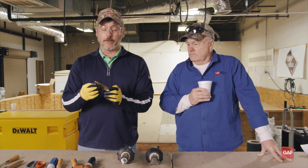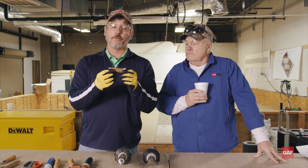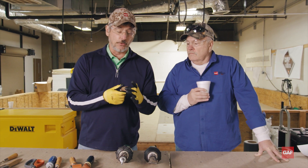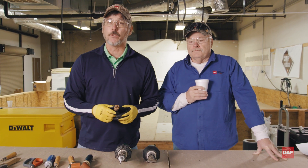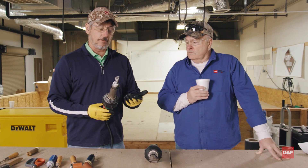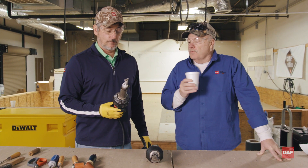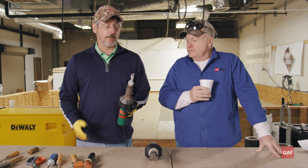The ceramic element looks something like this. As you can see, there's a big crack in this one — that could have been from shutting off too quickly or it just gave out. If you can, you should have a backup one of these in your work truck because they take some abuse, and when this element goes is when you're going to need it the most — rain's moving in, whatever the case may be. How often should you check these? I think at least daily, honestly. Minimum once a week or at least once a month. When you put them away, you should tear them down, blow compressed air through them, get all the dirt out, put it back together, and put it on the shelf. It takes about five minutes.